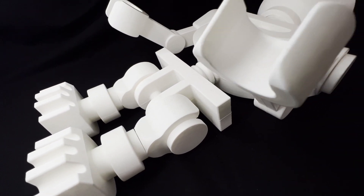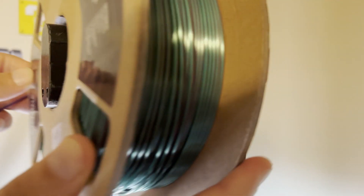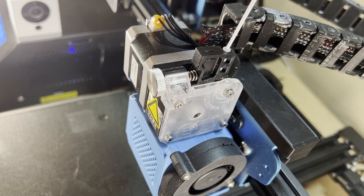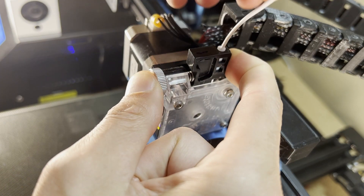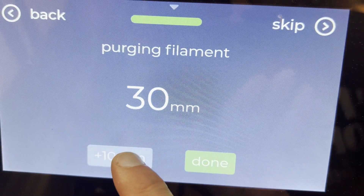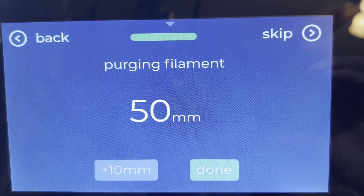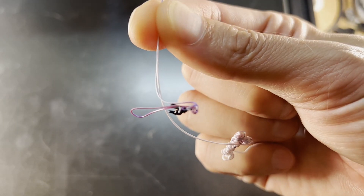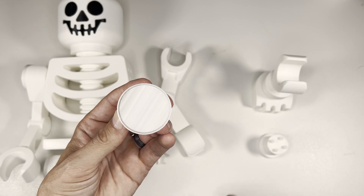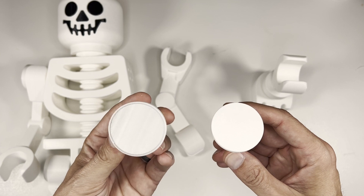While assembling this print was fairly simple, I'm going to share with you some tips and tricks to keep in mind. Make sure you purge before you start printing in white, or any other color for that matter. After changing filaments, I find myself purging anywhere from 50 to 100 millimeters worth of filament. Once you get a solid color, you're good to go. I was printing some black pieces before I started this skeleton, and... yeah. With that out of the way, let's go to assembly.